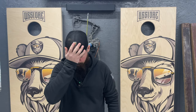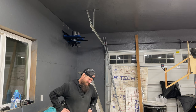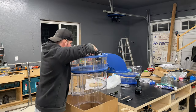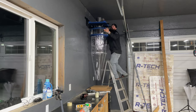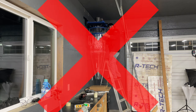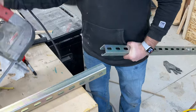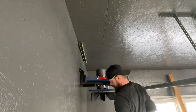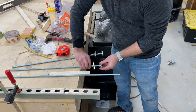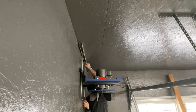Although I did get it onto the brackets, I threw my back out in the process. After recovering, I came out and installed the cyclone, only to find that my ductwork was a lot lower than I wanted - I had another eight to ten inches I could raise it. So I built this trapeze system out of some unistrut and threaded rod, which allowed me to install this into place and incrementally lift the blower housing up the additional eight to ten inches I wanted.